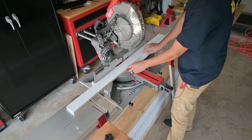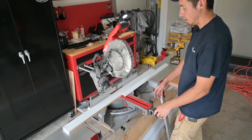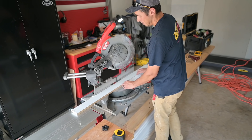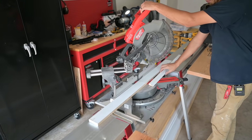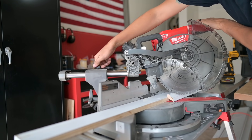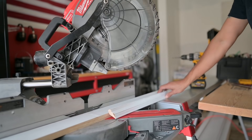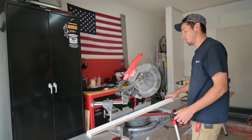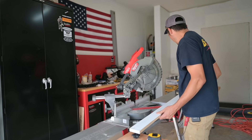For my offset panel molding — any offset panel molding — I'll just bring this one out and I'm good to cut. The saw won't actually cut through it because since it's a slider I can pull it forward. I can pull it forward and then lock the saw right here so it doesn't cut through my jig. These jigs are obviously just made from scraps and are pretty expendable, but it's just another idea. I'll throw that together real quick as well and then we'll get back to the crown.